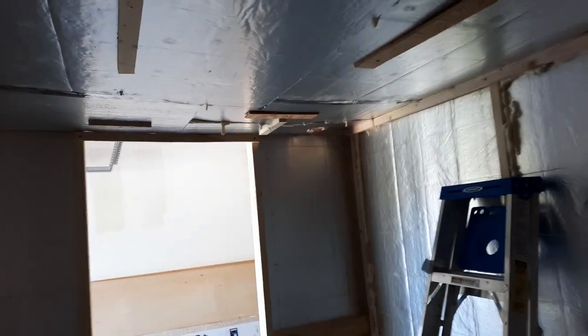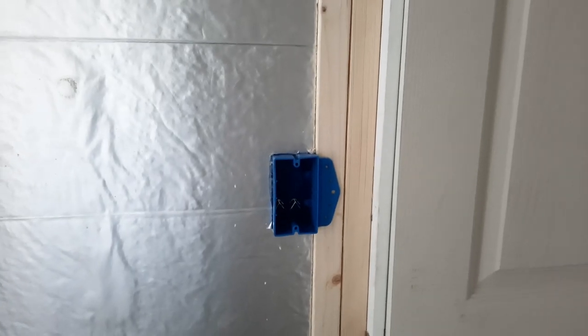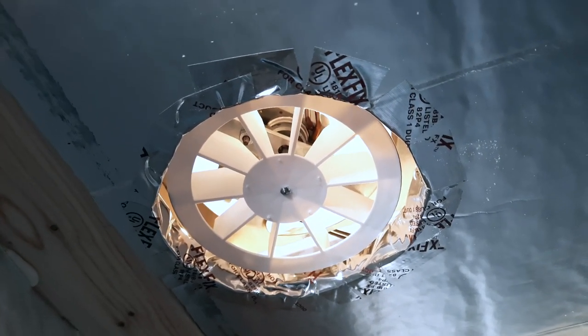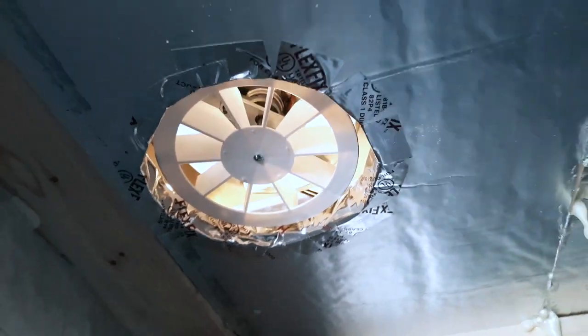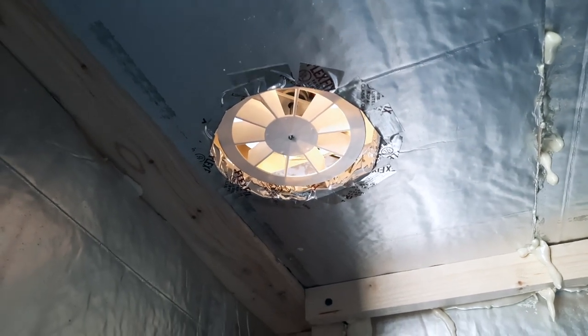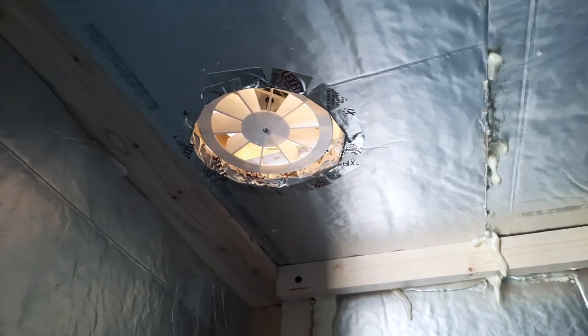I'm on the inside of the snake room. The ceiling is up and all the insulation is up. That'll be the last panel for the insulation — I'm just leaving it off for easy access right now. I've got the insulating foam — once that dries I'll trim it and all that will be nicely cleaned up. Now it's time to wire up. I'm going to wire a switch for the light fixture right here, and I've got one vent for my fan to circulate air from the temperature controlled garage in and out. That'll help manage the air temperature inside the snake room, and I'll have one more fan inside just to circulate air and keep a steady temperature. Time to get wiring.